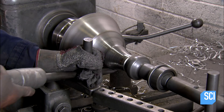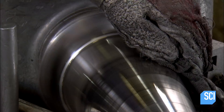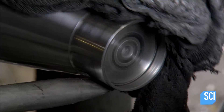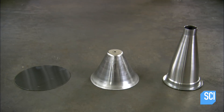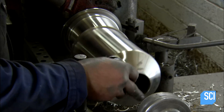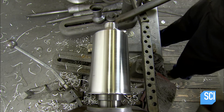Next, the inner wall of the ghillie kettle takes shape. Wielding a tool with force, a worker pulls and stretches the aluminum disk into a long cone. He inserts the cone in the kettle body. The gap between them will serve as the water chamber, and smoke will be vented out the center.